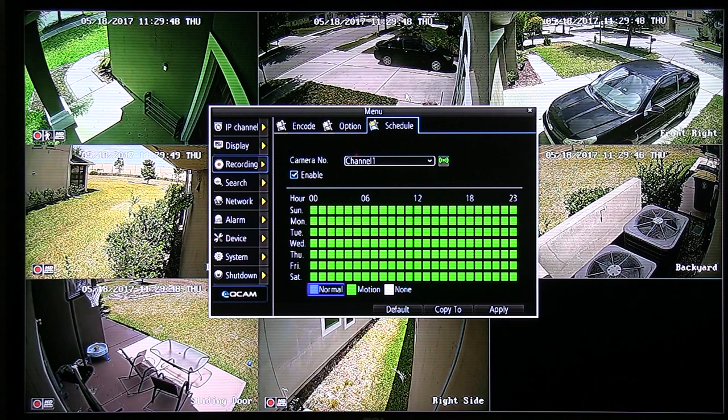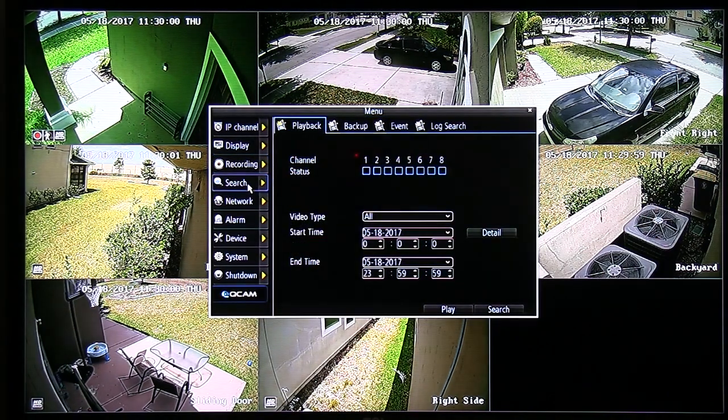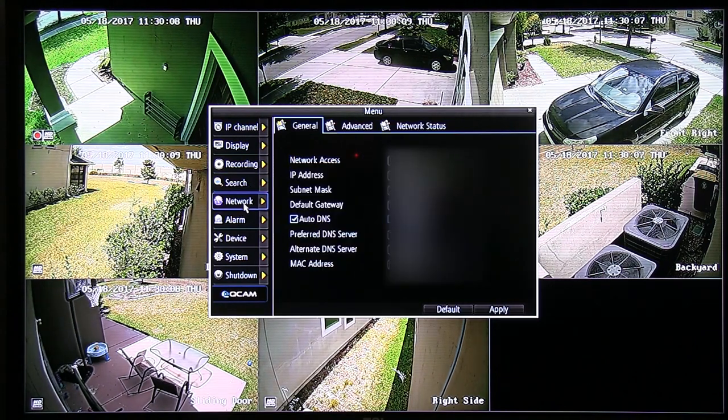You can use it with an ONVIF-compatible NVR or use an ONVIF-compatible camera with this NVR. The cameras have a 90-degree viewing angle so you can capture more real estate. Installation is a breeze and they do work with cheap copper clad aluminum cables if you make your own. I used both the included cables and CCA and found no difference between the two in terms of latency and image quality. Power over ethernet also works with my CCA cables. The NVR gives you neat features like the ability to trigger a certain set of cameras if one of them detects motion.